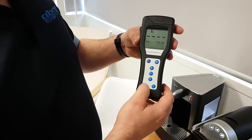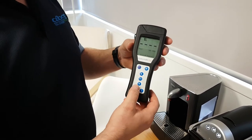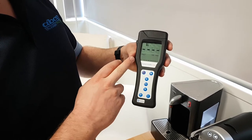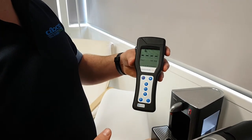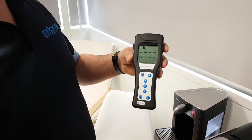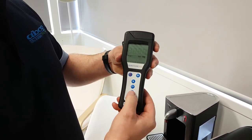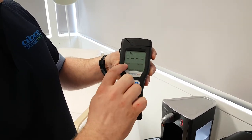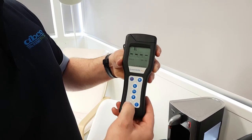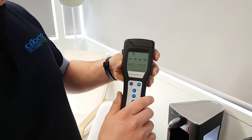For a food plant, industry standard is: below 10 is acceptable, over 30 is unacceptable, and between 10 and 30 it needs attention. You can create multiple programs for different applications. On program zero, it shows below 10 acceptable, over 30 unacceptable. Switching to program one, an acceptable pass is under 50, and anything over 100 is a fail.